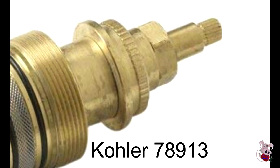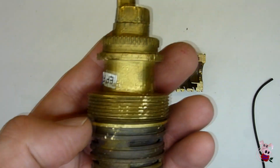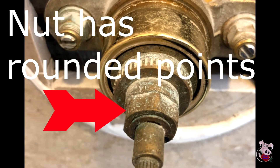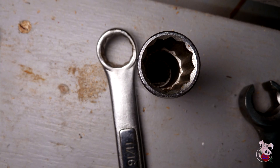You can see the valve has this distinct collar, but don't be fooled — there are a couple that look just like that. This valve is notorious online for stripping. If it's in there too tight and you can't get it out, you should have a socket that's the correct size — preferably a six-sided socket, not a 12 — so it's got a firm grip on all surfaces.